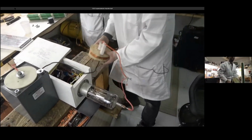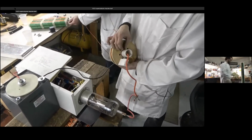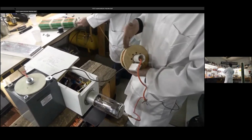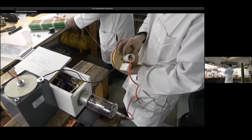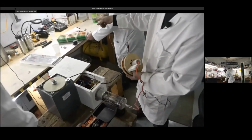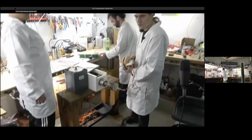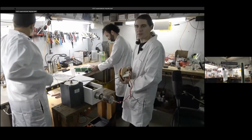at superconducting temperatures. Now we have to have the magnet on for the time that the superconductor is in transition through its phase of not superconducting to fully superconducting, so that it locks in the field created by this electromagnet. And that's what those batteries support. They're going to supply somewhere around 30 amps or so into this coil for about 1 minute during that transition phase to lock the field.